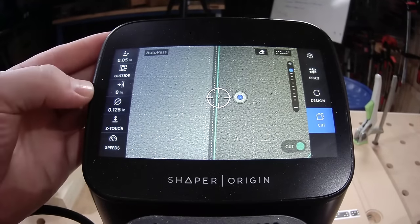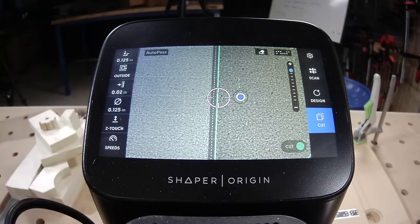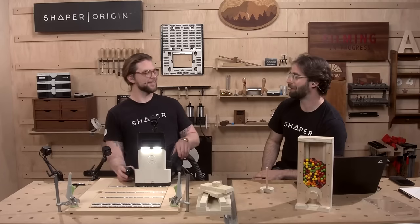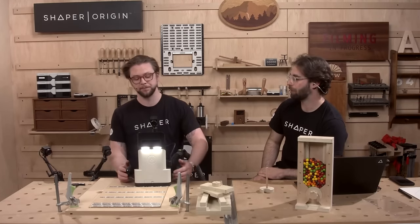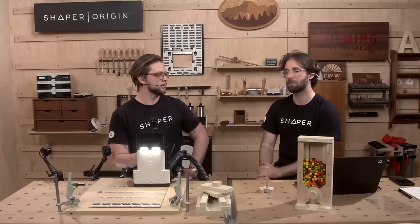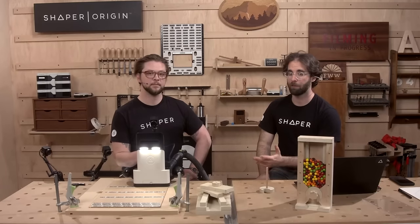Going at this with a 0.02-inch roughing offset, cutting down to an eighth-inch depth. We'll come back in for the finish pass — might hold auto for that to get a more consistent edge. The one thing to keep in mind: plastics tend to bunch up in a way that sawdust really doesn't. If you see stopping at all, that's to vacuum or brush chips out — completely normal. You can always hit the red button to pause and pick back up right where you left off. I changed my spindle setting to three today — that's a good move. As far as settings: plastics are more sensitive to heat than wood. Wood burns around 400–500°F; plastics start to melt around 200–300°F. You want to go a little more slowly. Listen for a good hum in the spindle — not a shriek, not a chug-a-lug — and make sure it doesn't smell like melting or burning plastic. Look for nice flaky chips, not too big or chunky, not too small or powdery.